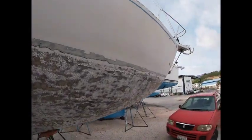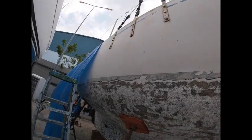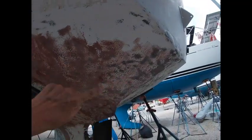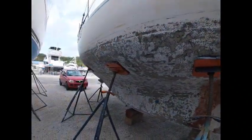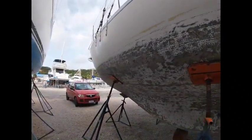and then that barrier coat's going to go on zippity-doo-dah. I'm up early this morning, ran out of epoxy last night, so I had to stop at 3 and run to the store and get another gallon of epoxy for the fairing, but it's all going well. I just have about half of the water line here on the starboard side to get off. And this is the part I started the other day, and yesterday I did all the way to here, which now looks like a fair bit, but then if you look at the rest, there's quite a bit more to do.